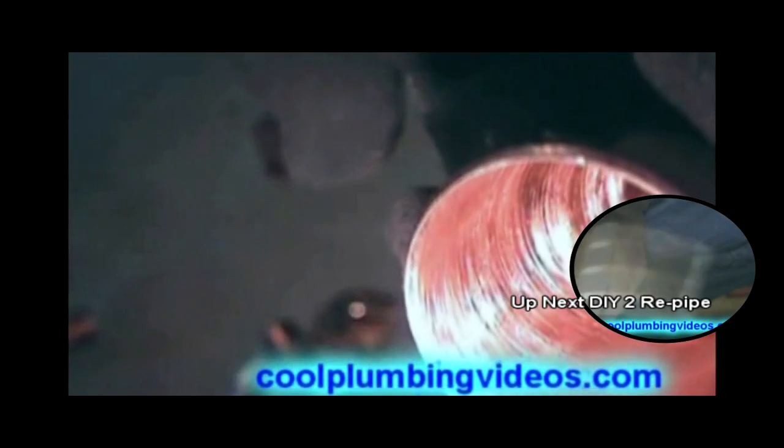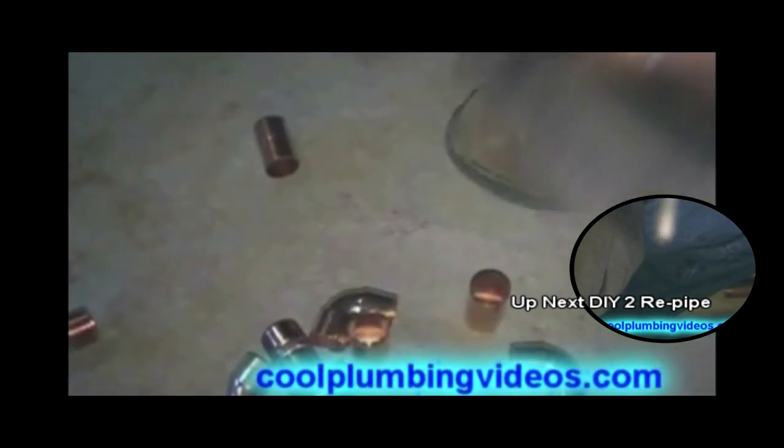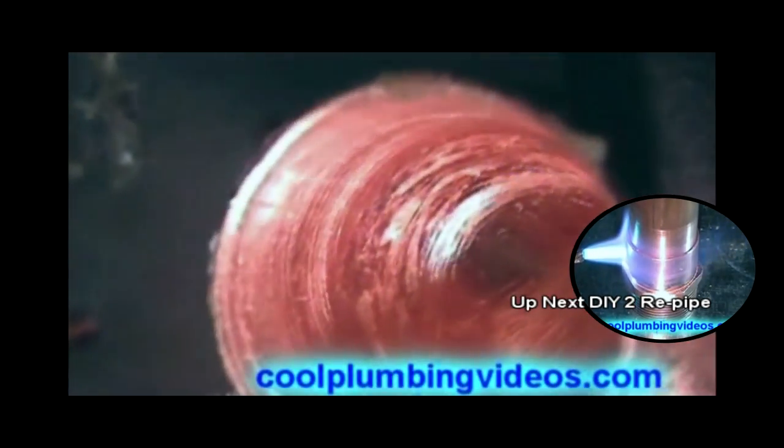And what you see me doing here is cleaning the edges of the copper fitting. That helps to also make a better weld or solder joint. And here we're applying the flux, which will allow copper pipe and the copper fitting to solder together.